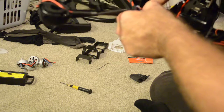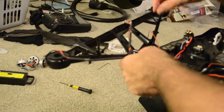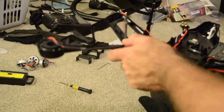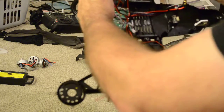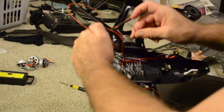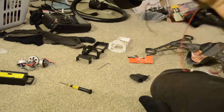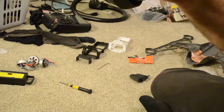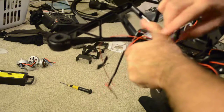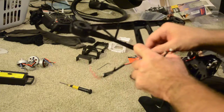I'm going to press this guy in here pretty good to get it in. Let's check where the antenna is going — that's the antenna that goes down into the legs of it. So let's put it down through here and out the bottom of the aircraft. You'll tape that onto the landing strut. This remaining antenna here goes up into the wing, so here's the wing and it goes up into here. You've got to tape that on because you will slice it when you put it back together if you don't.